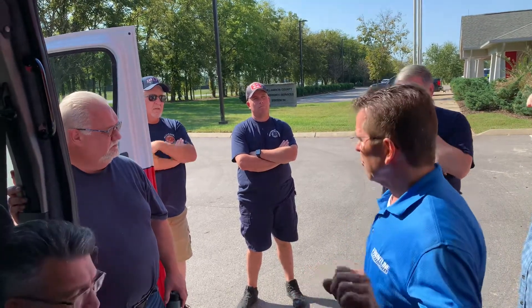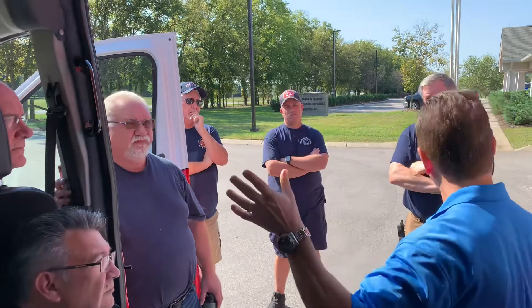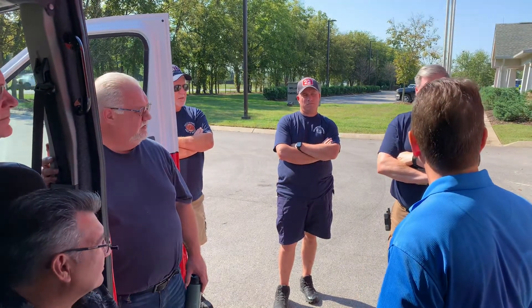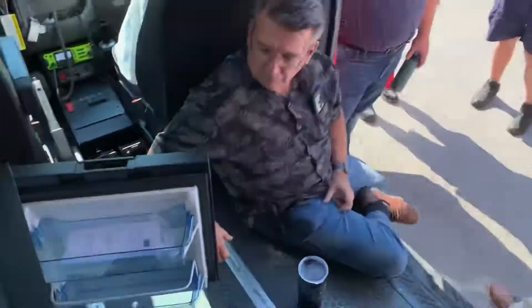Your system batteries — it does not control the truck battery, you can still start the truck, that's a completely separate system. But if you shut those batteries off, it preserves the batteries from any parasitic draw, like somebody forgetting to cut off the comms breaker. But that's something we've got to talk about, because normally you guys like to have things nice and cold. If that's the case, leave the shore power in, leave it on charger only. Because the refrigerator and freezer are 12 volt.